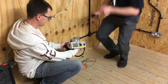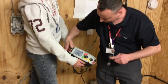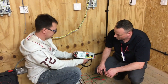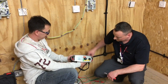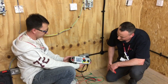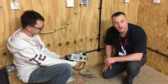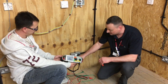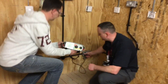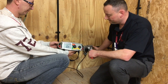We're getting readings of 0.02 and 0.03, flickering a little, so we zero them again. We get 0.03, turn off the outlet — it's part polarity testing — then plug into the other side of the socket. We get 0.03, turn it off. You have to operate the switch on both sides of the socket outlets for polarity purposes — partly proving polarity of pins, partly proving wiring as a ring final circuit. Moving on to the next socket, same process: 0.03 and the outlet goes off.